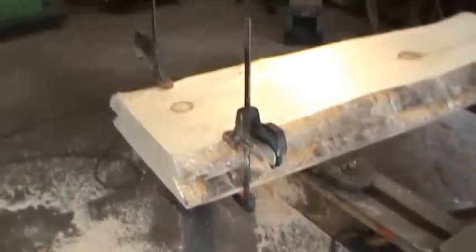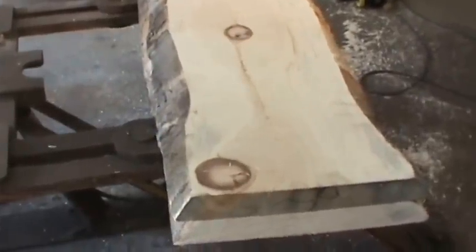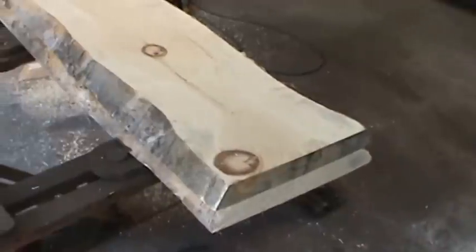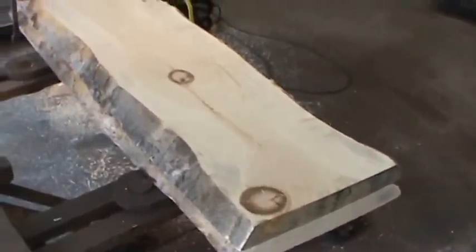Now in more manageable pieces. I'm a bit of a noob when it comes to wood — this one had a '30' marked on the end and the guy said it's two and a quarter — a board foot. A board foot is 12 inches wide, one inch deep, 12 inches long. So there are 30 board feet in that piece, and the whole thing came to about sixty-seven fifty. Not bad. And it's pine — there was a hardwood piece in there that was 400 bucks.